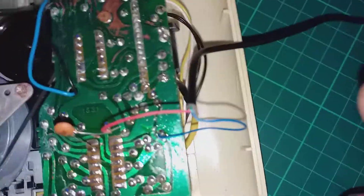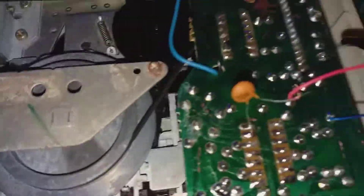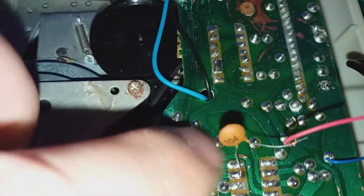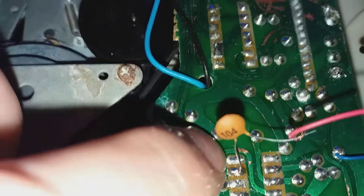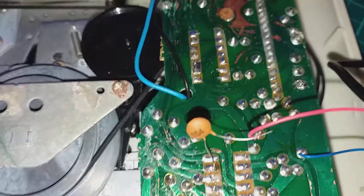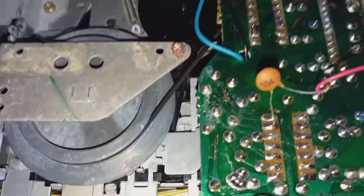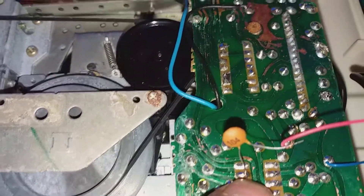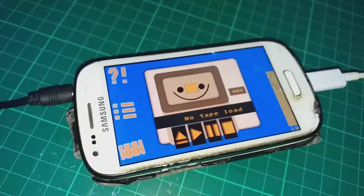The red one is the left audio out and it is soldered to a 100 nanofarad capacitor, and it is soldered to this DIP chip. Looking at it from the top, on the left, the second one is the non-inverted input. If you want the inverted input you'll need to use the second one from the bottom. I'm using the non-inverted one.